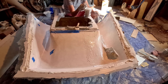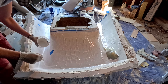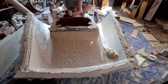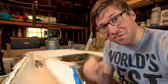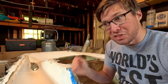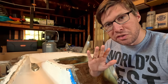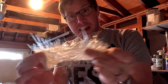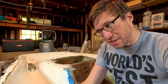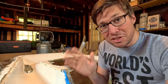I've been working on this mold for so long — I really want to work on the actual part for the boat, not on a mold in a workshop. So all the steps to get up to now have been: make a pattern, make a mold on that pattern, take the mold off, lay down some mold release agent, then the gel coat. And today, the coolest part — we're laying down the first layer of fiberglass for the actual part. This is what people are going to see when they look at the piece.